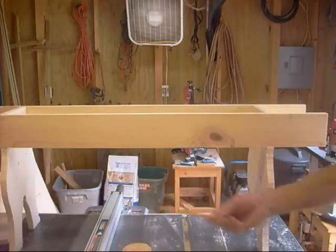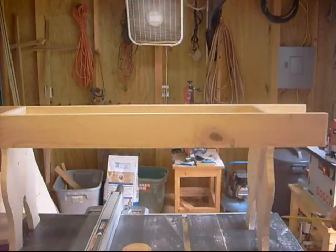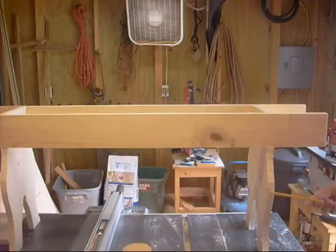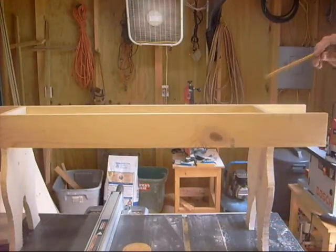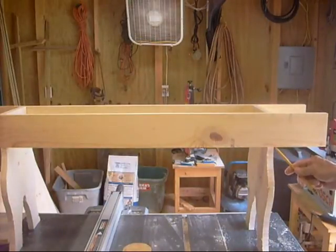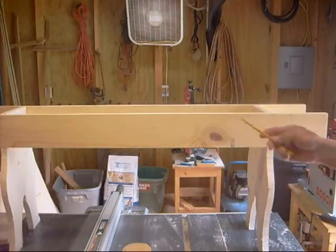We're going to put this edge, these 2 pieces together, the 2 legs. I just put a little clamp on them and hold them, but you can tape them too with double-sided tape. And we're going to run that on the sander and sand these things nice and smooth with some 80 grit, and get them matched. Then here, you see, I got a little space here. We cut that off there. We'll just sand that all down so it all blends in.